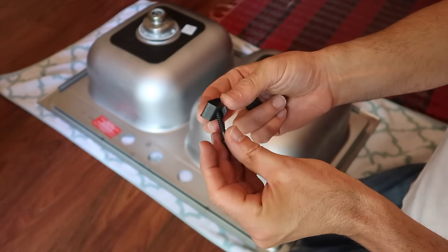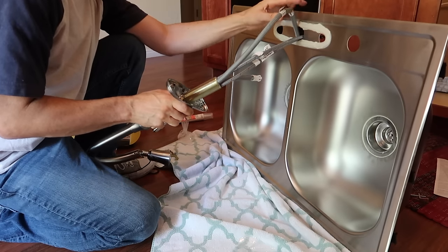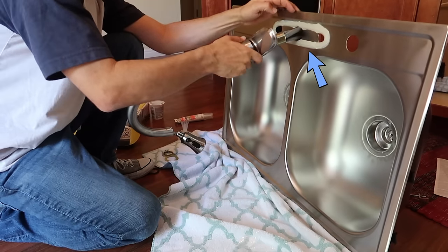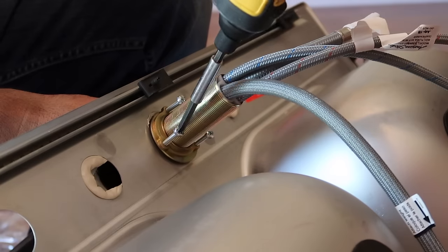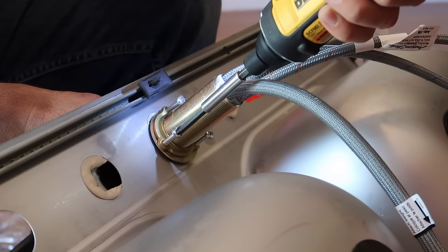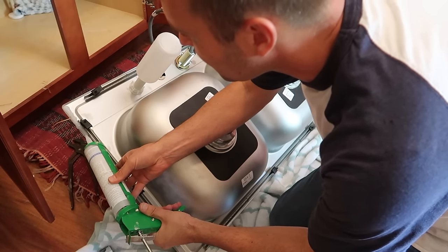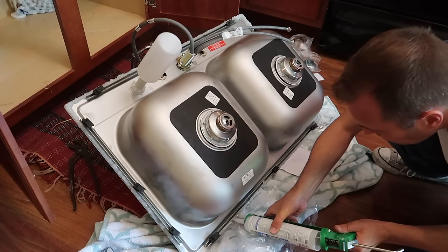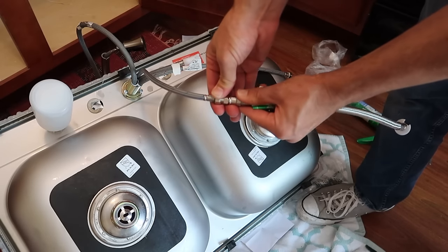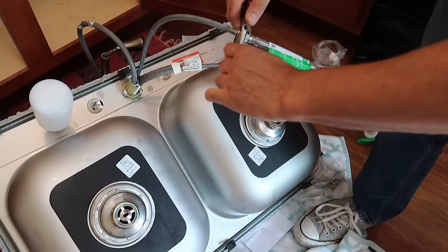This is a different style of clamps — I'm getting them all ready before I put the sink on the counter. Here I put a bead of silicone on the base plate so that water doesn't leak out underneath the sink. This is the nut that secures the faucet. Next, you're going to want 100% silicone — with a stainless steel sink, use clear. Put a generous bead all the way around the edge. Normally do the silicone last, but I forgot a couple of connections here. These are new water lines — the old ones were too short, so be prepared: you probably need new water lines.